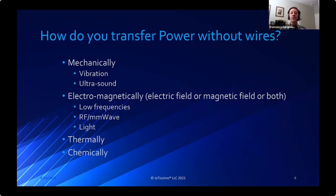One of the issues with ultrasound type of technology that makes it challenging in some applications is the fact that the energy you can extract is really very much dependent on the volume of the receiver. That's one reason why it has been difficult to use inside the body - if you want a very tiny sensor and power it at a distance through ultrasound, size matters when you talk about mechanical energy.